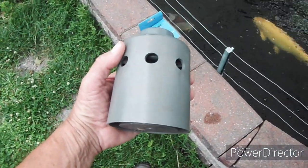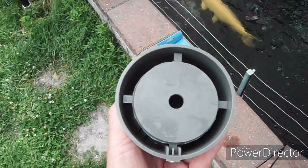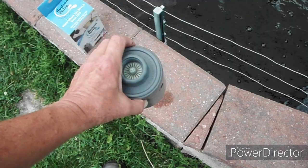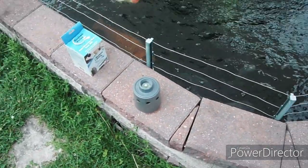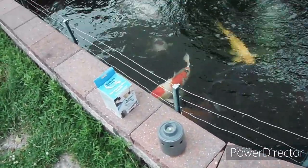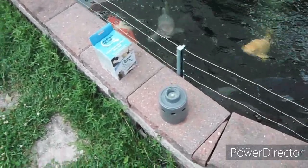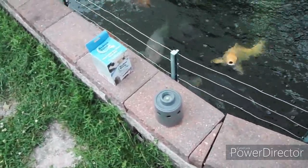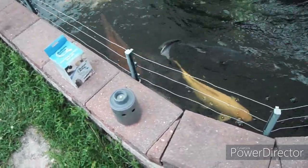This is what the unit itself looks like — a very simple connection on the top and that's the float in there. Rather than a lot of the standard valves that you see that have the little float that goes up and down depending on the water, connected to an arm which is then connected to the filling point, this has a diaphragm inside it that functions under very little pressure to allow water in and out as required.